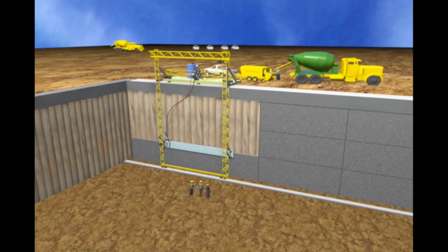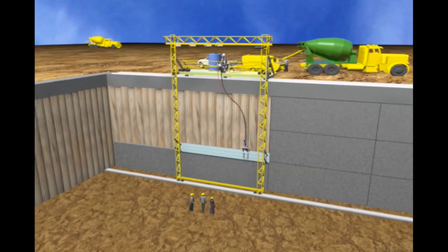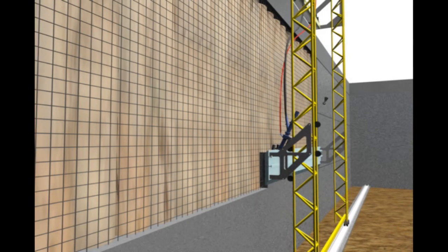Now the system is relocating to place concrete on a second tier. Say this irregular wall thickness averages around 10 inches — the ideal lift is actually around 8 inches. If you are placing concrete at 60 yards an hour, then a 25-foot pass of the carriage takes 30 seconds. This is absolutely no problem.